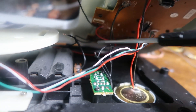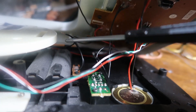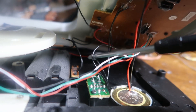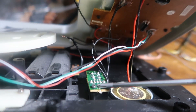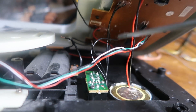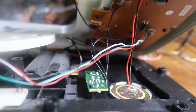Over here is the battery — there's a red wire and also a black wire. This black wire over here used to connect to this one, so I've severed it and I'm going to connect it to these two wires that used to go to the switch, essentially converting the switch into an on-off switch instead. I'm going to solder this wire to there, this wire to there, and then patch it up and we'll see what happens.